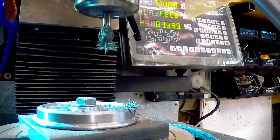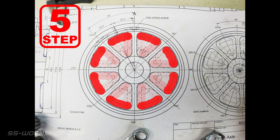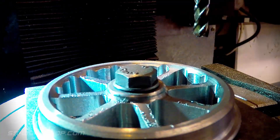With the sides of the spokes complete, the final machining operation is to cut the inside curve of the outside diameter. This is done by setting the X axis to the diameter required, the Y axis to 0 on centre with the part, and cutting with the rotary table unlocked. This will allow the curved cut to be made.